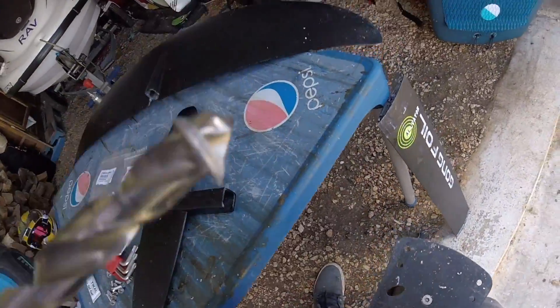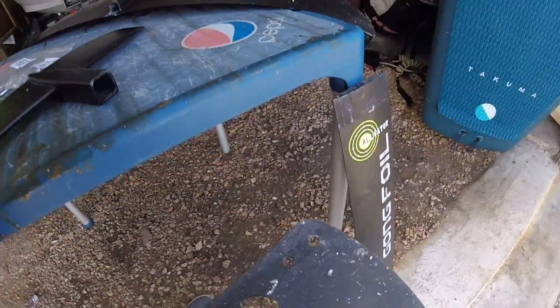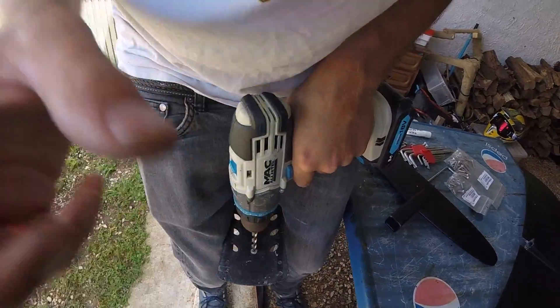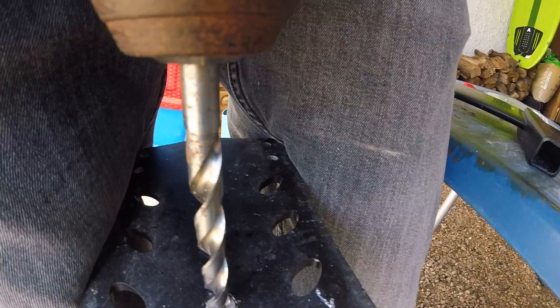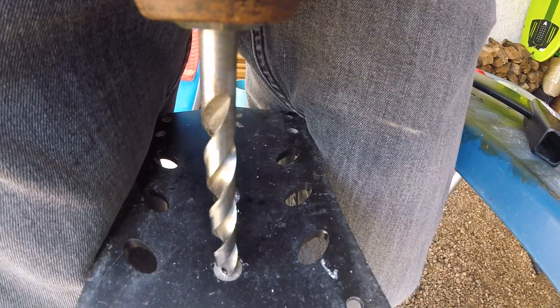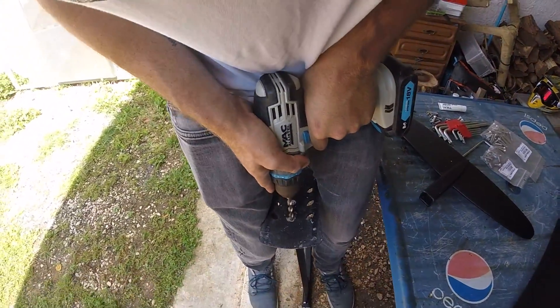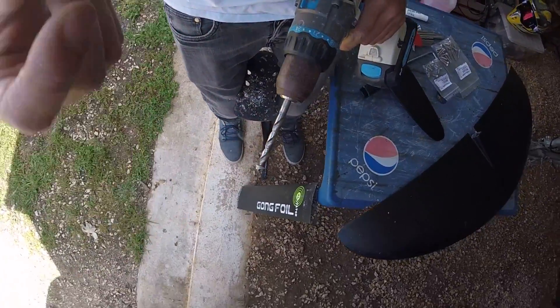As you can see I managed to get the head off, so now I need to do exactly the same thing with that screw again. You want to make sure the top of the drill bit comes straight inside the hexagonal print so it's centered. That was quick.